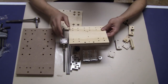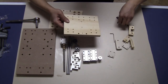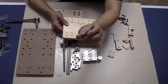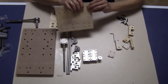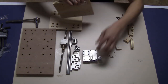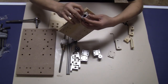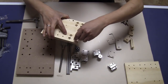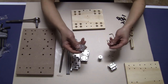For the gantry plate I have two versions. One just doesn't have the pocket here. The reason is I only found 20mm M4 bolts at the store I went to, so without the pocket it doesn't fit — if I put on the spacer and install the bearing it's not long enough. So I had to make another version with the pocket going down about 5mm so I have just enough to bolt in the bearing block.